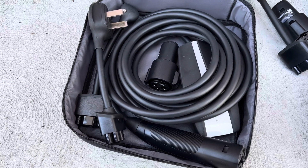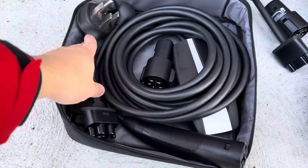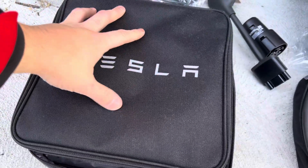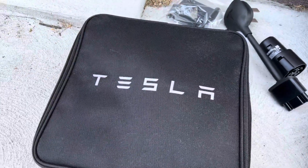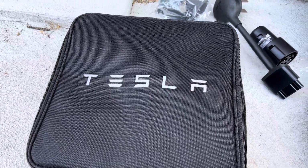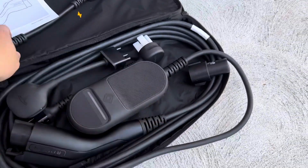And what do you really need? For the most part, I advise the 14-50, and for first-time EV buyers, make it as flexible as possible. Also remember, as of right now, there's a federal tax credit for installing a charging station. It's 30% or $1,000, whichever is less, of the install cost. I believe it's the same for commercial as well, except with a higher cap of $10,000 or 30%, whichever is lower. I do hope this helps you guys.